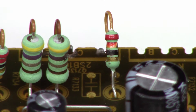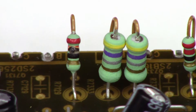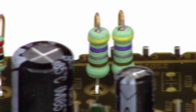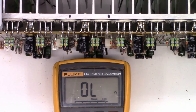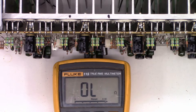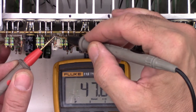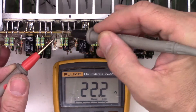I've got the board up here in slightly better lighting, and if you look at that resistor, you can definitely see a defect, as well as that one right there. Now all the rest of them look absolutely fine, except for maybe being mangled. So I've got my voltmeter in the 600 ohm range, because I'm going to be measuring 22 ohm resistors. I'll short the leads out — lead integrity is about 3 tenths of an ohm. I'm just going to go ahead and test one of these over here that is a known good resistor, and we see 22.2 ohms, which is absolutely perfect.